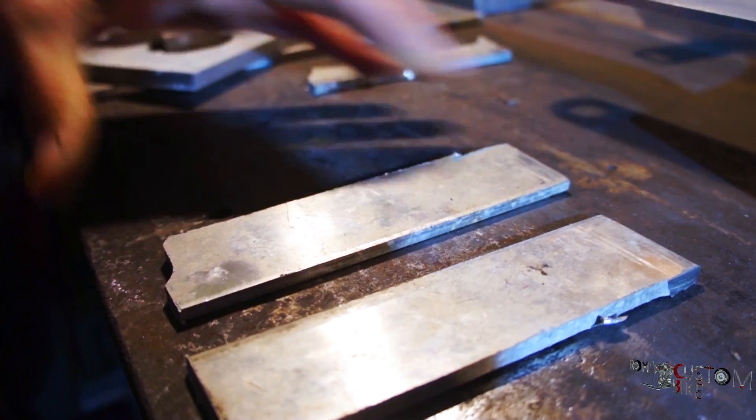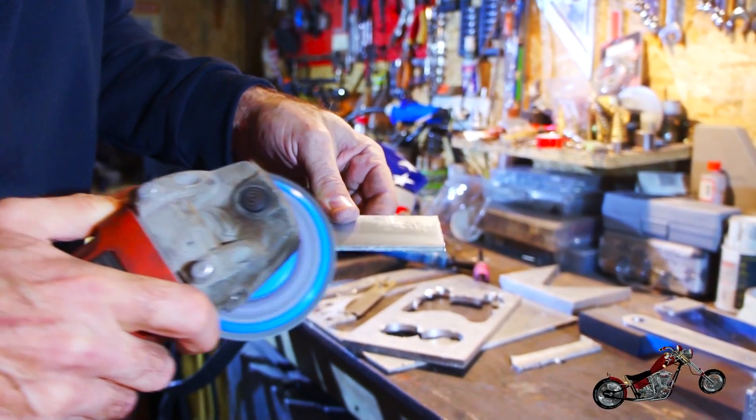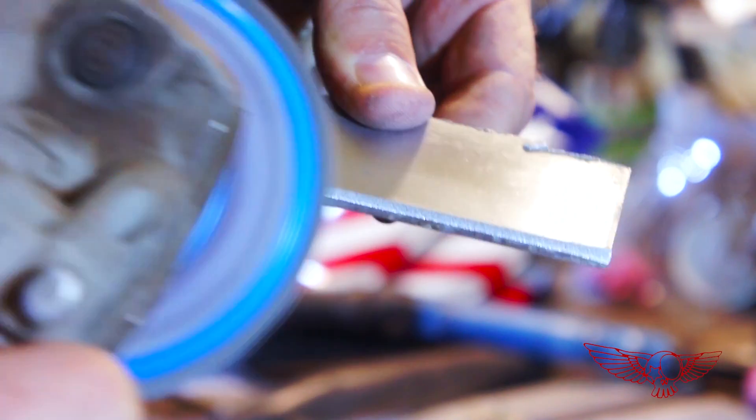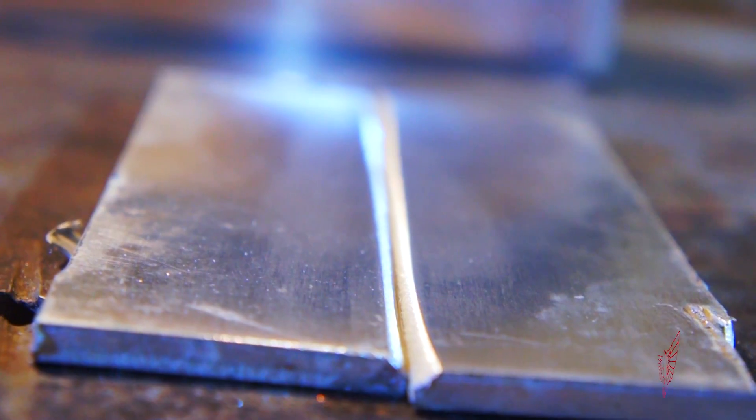To achieve great results, another important step is the cleaning and preparation of the piece prior to welding. For this demonstration I have prepared two pieces of 5 mm scrap aluminum left over from another project. We start with some sanding to remove the impurities on the surface, and then we bevel the edges to create a v-shaped gap between the pieces to ensure a nice and deep weld. This makes for a nice and low weld, saving us some time in the finishing process as well.